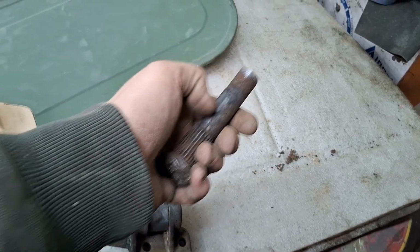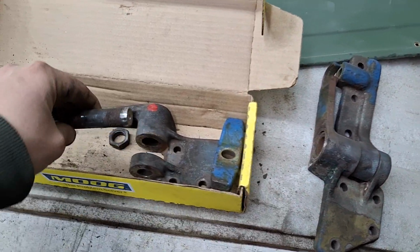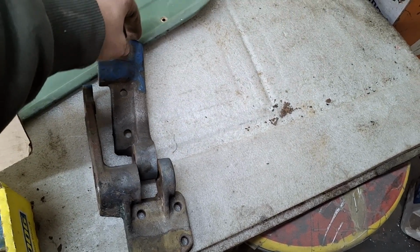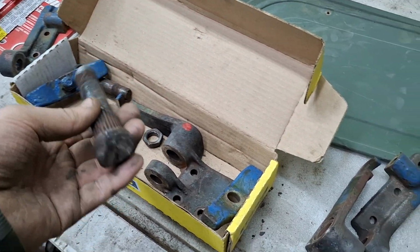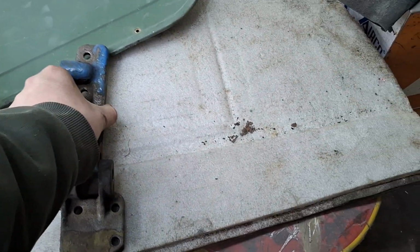And then put a little slot, and then let the grease work its way across. So then it's all greased up, and it will pivot pretty smoothly. It'll never seize. So that's the plan. Give these to a friend, get them machined, drilled out, Zerk fitting. After these are all blasted.